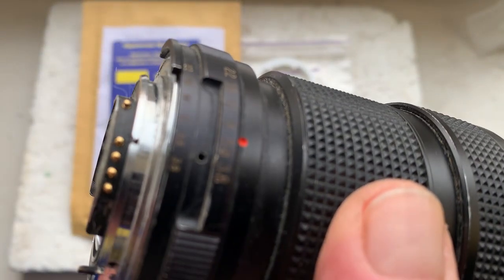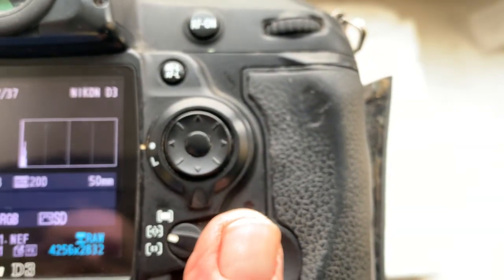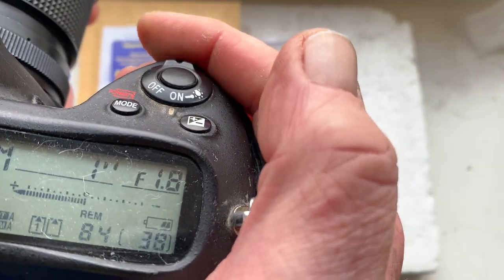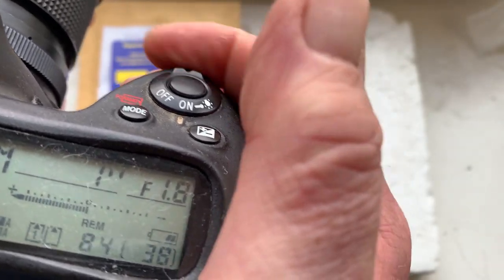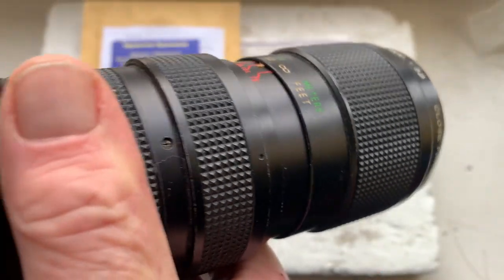A little piece of double-sided adhesive tape is included and sent together with the chip. I programmed the chip: focal length is 50 millimeters, aperture range from 1.8 to 22, and focus trap mode is on. You can always reprogram the chip and adjust the confirmation point from our programming instruction.